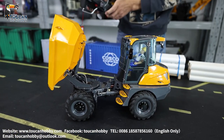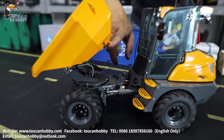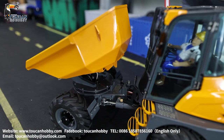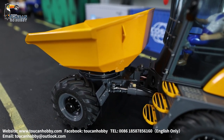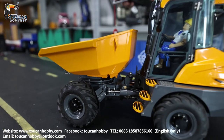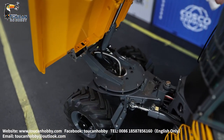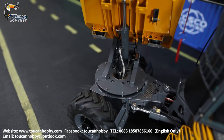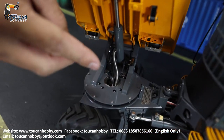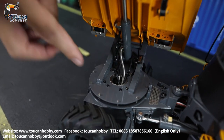Let's get the bucket down. You can see here there is a V-type locking — this should be in the turning position. Now you cannot make the turning because the switch is already compressed. Also, underneath there are two limit switches. When reaching this end, the limit switch touches, so we have to stop it from turning.